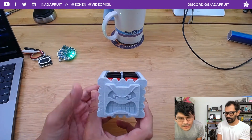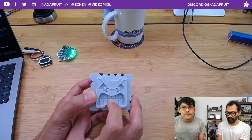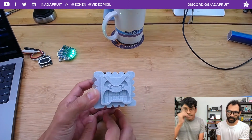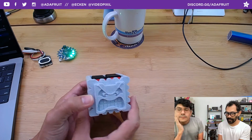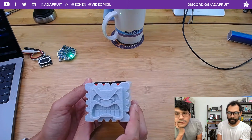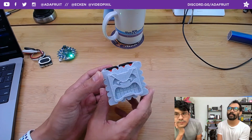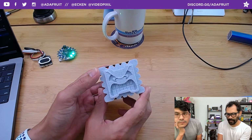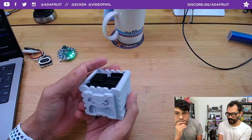Yeah, so the only thing that you do have to remember to do is enable the supports. I did print one before and all of the overhang, unfortunately, just because of the weight design, you could have added like some gussets or something all around the lips and the eyelid areas. But yeah, you're definitely going to need the support material enabled for that. Just use whatever Cura decided to generate, at, I think, 70 degrees. And that should do a pretty good job.